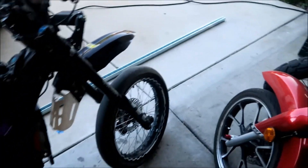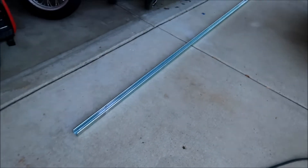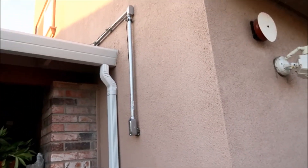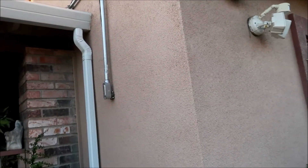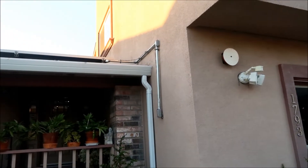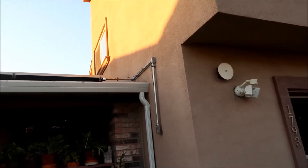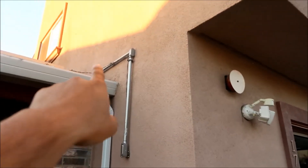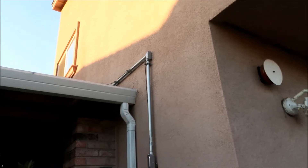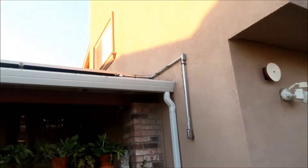There's no way we're putting a fourth string on this system. We could add another solar panel if we had another inverter charger, but that would mean another home run wire out of the wall. Also, the bends are really tight — four wires won't fit through there. We'd need to change to bigger, more spacious pull boxes. But we could totally add more panels later; for now we'll go with three strings.